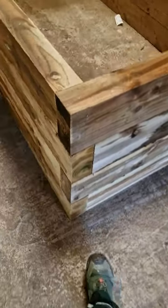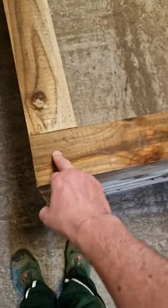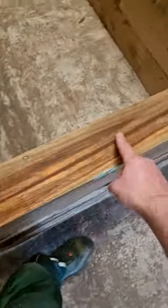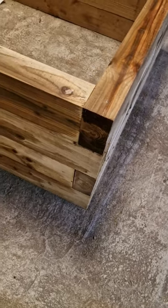Once you've done all four corners, get your screws in all the way around. I've got a bird's-eye view map that shows you how many screws to use. In every corner you do big bolts — the bolts go all the way through into the course below, so they're really big and strong. Put one in every 150mm or even less. We send out loads of screws because we prefer to use a few too many rather than too few.